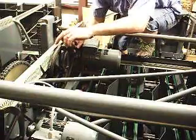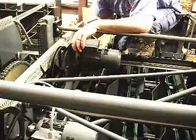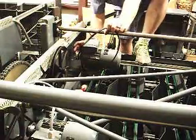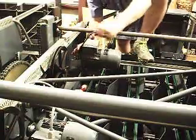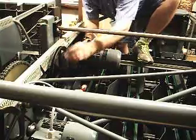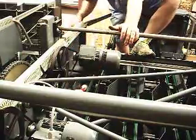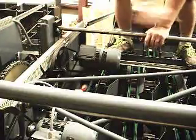Remember, it's always best to put the belt on the motor first, because this goes across a smaller wheel. If you try and go over the bigger wheel on here, you'll stretch your belt out a little bit more than you want to. The bigger wheel is designed if you wanted to run your table faster. Put it back across — there we go. We'll start it up and see if it at least sounds a lot better than it did the first time I ran it.